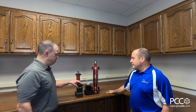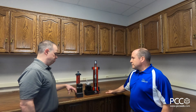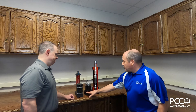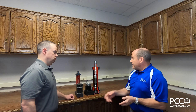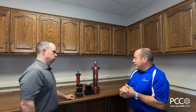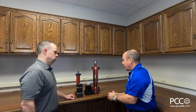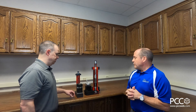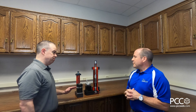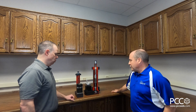When it comes to the actual motors — you have an AMCI motor here, and PCC is a Siemens distributor. Does it have to be a specific motor or frame? We have adapter plates for motors of various sizes. If you choose, you can ship the motor to E-Drive in Connecticut where they will drill and tap for any motor, mount it, tension the belt, and close up the actuator into a complete package ready to ship to the customer. We had an application recently where we shipped a Siemens motor to E-Drive and got it back as a complete, epoxy-painted unit — the customer didn't have to do any mechanical assembly.